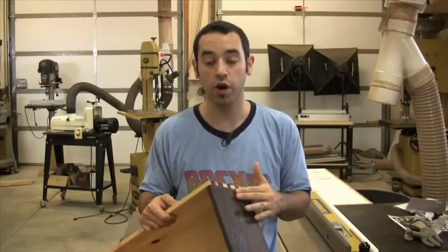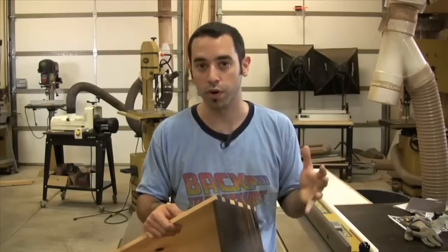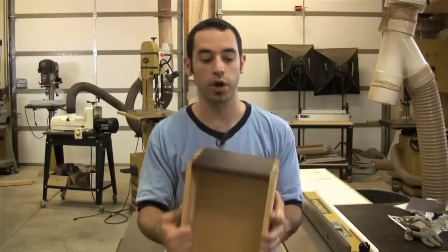And not to mention, like I said, if you follow your manual that came with your jig, you shouldn't make this mistake. It was just a silly thing that I did. So I just wanted to post this correction so there's no confusion. I'm not going back and redoing the whole video. I think it's critical that you see that this is a very easy mistake to make. Correcting it just means literally recutting your parts and starting over. There's no way to convert a tail board into a pin board unless you happen to cut it extra long.